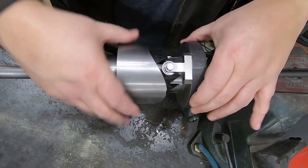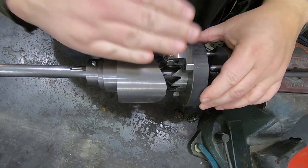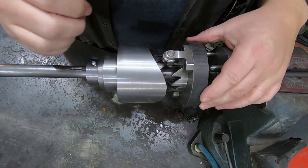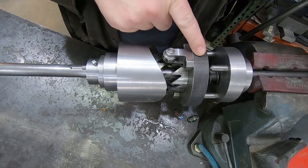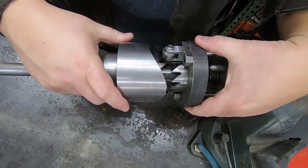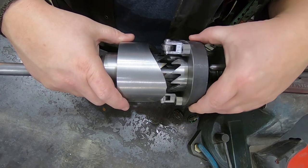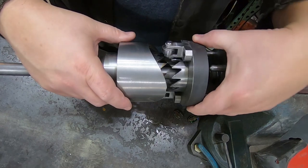The important thing to know is that this piece here, this is the main cam, and as it rotates, it's moving up and down clapping mechanisms. And there's another one that's static, but this one needs to, in addition to rotating with this shaft, rotate 1/12 of a rotation relative to that shaft on a regular interval as part of the performance.